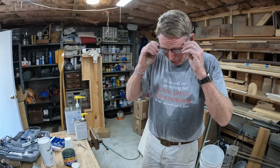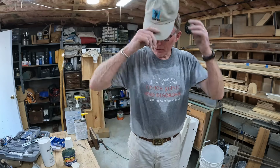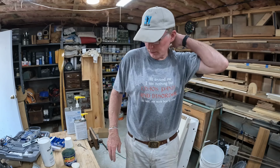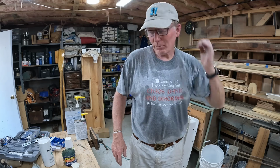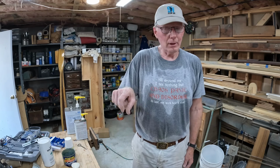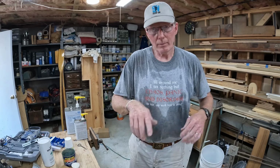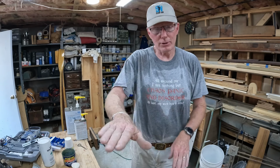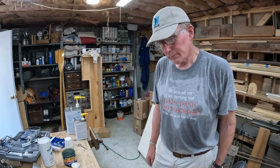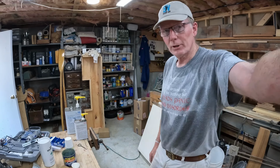So I'm going to mix up another batch of epoxy and some fairing compound and go out and put another coat of fairing on. You can see as I'm sanding, there are still some little depressions. The light color as you're sanding off, and you can see the darker depressions where there's still a little low spots. So one more coat, at least, maybe two. We'll see.